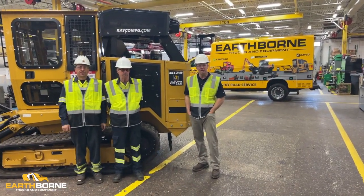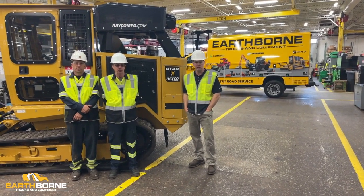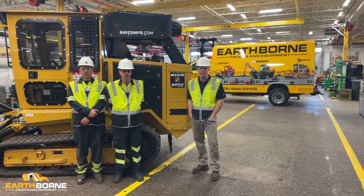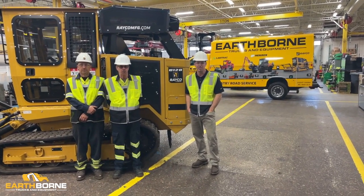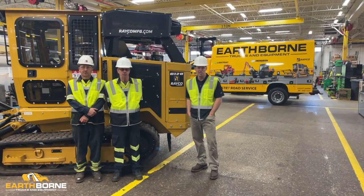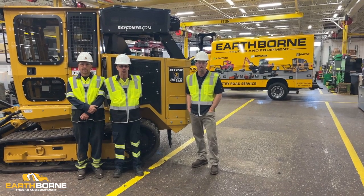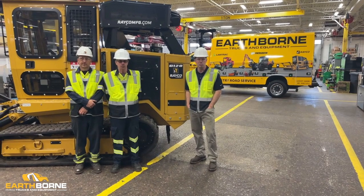That's about everything that the operator and the crew should do to care for the machine between our visits every 3 months. Those are the things that you're going to want to do daily, weekly, monthly, really so that your machine is running the best that it can. You can pick up 20% more productivity with a machine that's running the way that it should compared to a machine that needs service, needs maintenance, needs little things like air filters cleaned out.